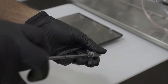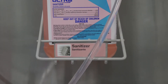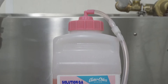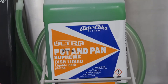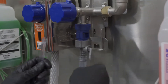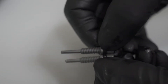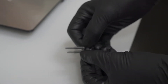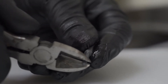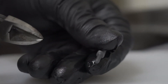A single needle valve configuration cannot handle all dispensed products. The standard needle valve is capable of dispensing the full range of water-thin products, but thick products such as hand dishwashing products — pot-and-pan, pot-and-pan supreme, ultra-pot-and-pan supreme, and similar products — require a needle valve with greater clearances. The technician can either utilize a special needle valve or modify the standard needle valve to accommodate thick products. The extra steps necessary when dispensing thick products will be covered later.